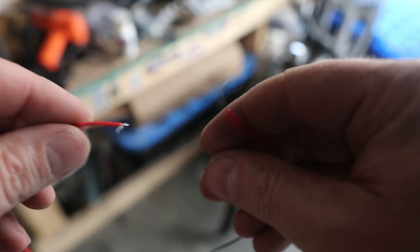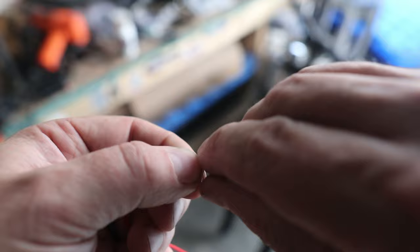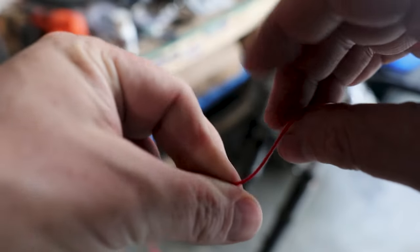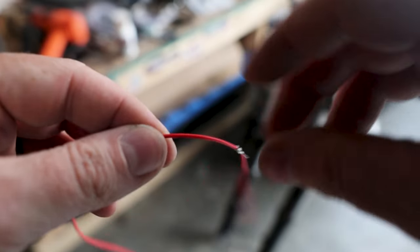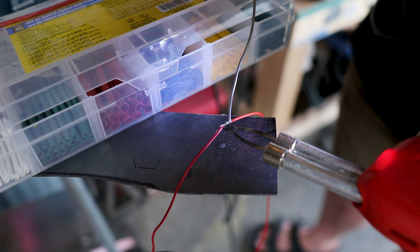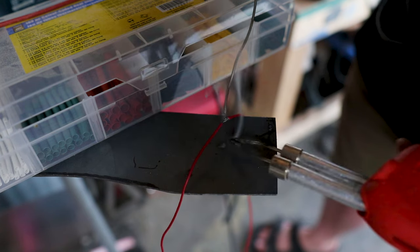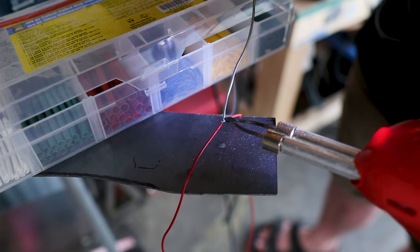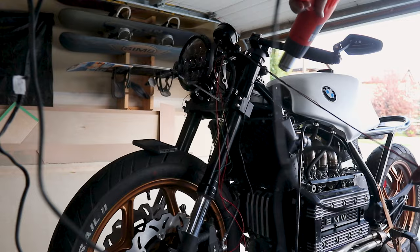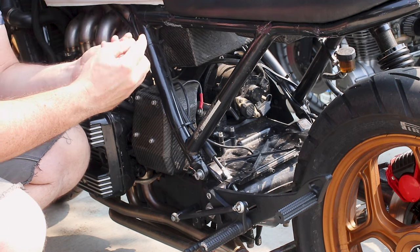The next thing I needed to move on to was rewiring the Moto Gadget Mo Button. Here's a little trick about soldering: when you put your wires together, especially little ones, force your wires together and give them a bit of a twist so they're grabbing onto each other a little more before you start soldering — I saw someone else do this, so I can't fully take credit. Over the years I've also started using flux when I solder. The flux really gives you the ability to help the solder flow a little bit better. I'll go into more detail in the full video about rewiring the handlebars and how I use the Moto Gadget Mo Button.